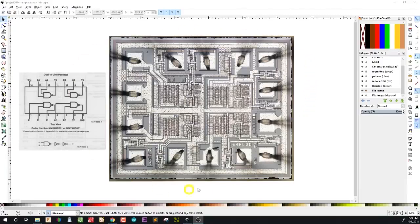This is a 54HC00 quad NAND chip. It's CMOS and here's the number right on the die. This is a die photograph, so I thought I would reverse engineer it from the die. We can see a whole bunch of pads around the outside — these are the bond wires that go to the pins on the package.